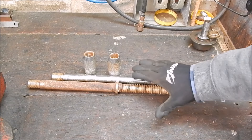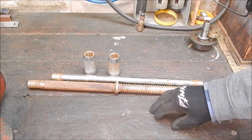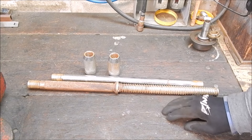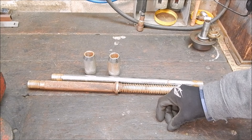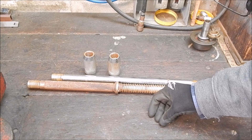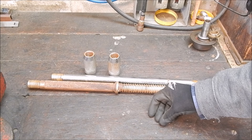The actual use of the steel often gives away the characteristics you're likely to find. The application could mean it needs high tensile steel, springy steel, or it might be mild steel or high carbon steel — there are just so many variations. The steel's cheap, it's free, but it could be a lot more difficult to machine. It may even be unmachinable with a conventional lathe. If it's super hard you may not be able to cut a thread in it. I've got some big steel round stock that is so hard it's basically almost unworkable — I certainly couldn't cut a thread in it.